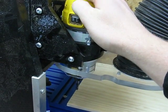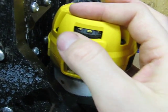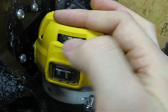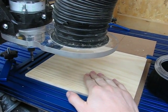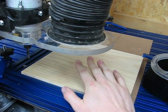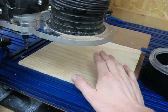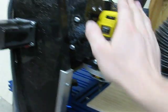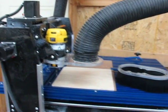...this thing doesn't even slow down. It's awesome. I can pretty much run this on speed two or three, depending on the bit. Quarter inch end mills I pretty much run on two, eighth inch bits I'll run on three. In pine I can run 120 inches a minute without any trouble. If you go much faster than that you get a fuzzy cut. In MDF, 150 inches a minute is about what the Shark will do, but it has no trouble cutting 75 to 80 thousandths at 120 inches a minute with the new router. You couldn't even begin to do that with the Colt.